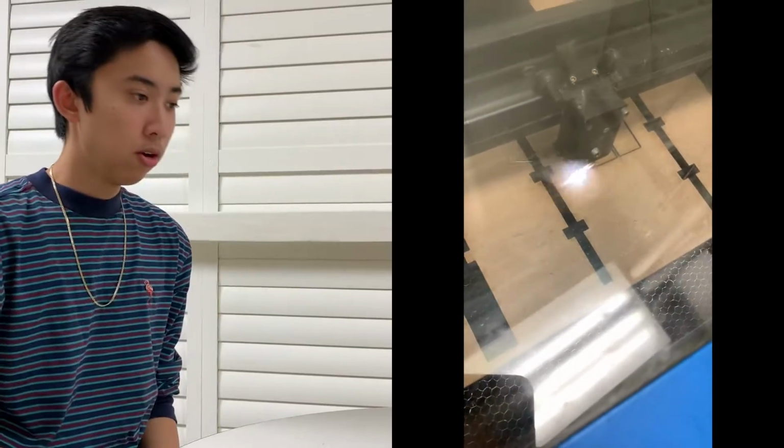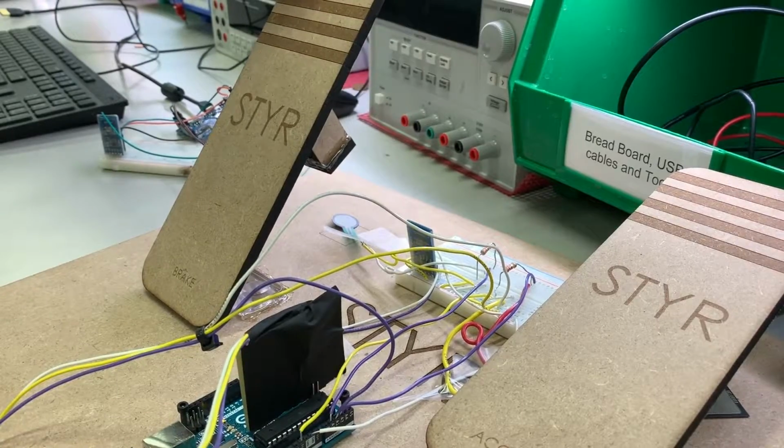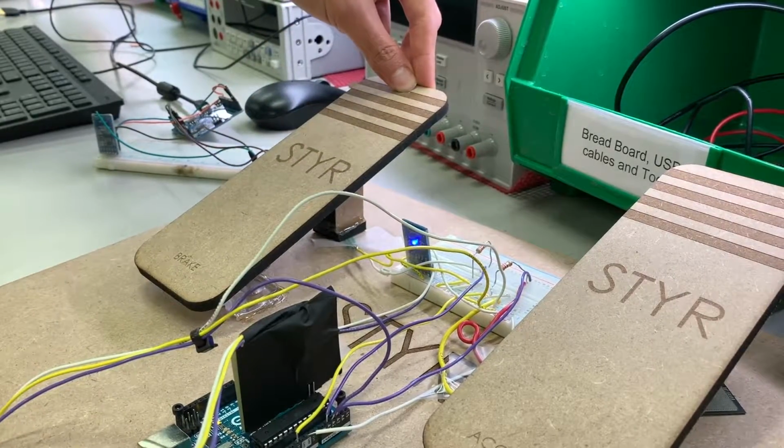After we got the pedal assembly, we first laser cut the pedal assembly piece with the STYR logo on the end of the pedals. We then also created stands that put the pedals at the desired angles to retain true-to-life qualities, where in a real car, the gas pedal is at a lower angle than the brake pedal. We chose different heights. Three sheets of 1/4 MDF were glued together to support the pedal. We used trigonometry to find the correct heights of the pedal supports. Lastly, we created square bases for the supports to rest on the pressure sensors.